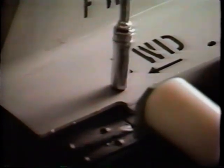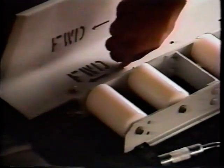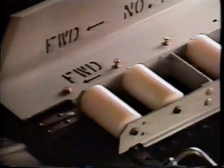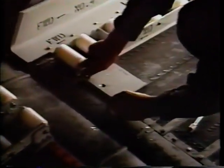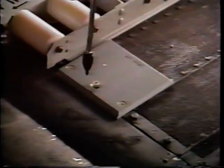To begin the actual installation of the ramp section, position the left and right hand outboard guide rails on butt line 41.577 and butt line 42.432. Align the bolt holes with the outboard holes from which the bolts were removed. Attach the outboard guide rails to the helicopter ramp floor using one hex head bolt and one flat washer at the most forward bolt location on each guide rail. Secure each outboard guide rail at the remaining bolt locations using the remaining 11 hex head bolts and flat washers. Position the transition roller plates on the three holes located at or near butt line 32.024 on each side of the helicopter ramp, and secure the plates to the floor using three countersunk bolts each.